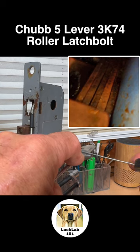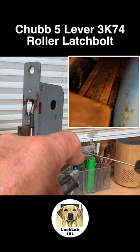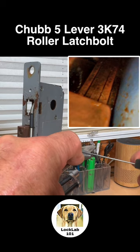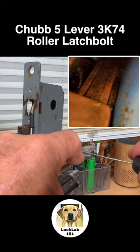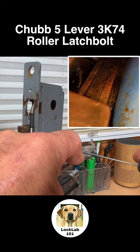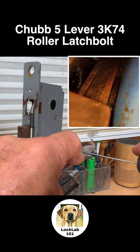Let's try three. Three is bound. I've just lifted three up and the lock has gone into anti-pick. One's tapping, two's tapping, three's tapping, four is tapping, and five as well. One of these is in anti-pick — I'm not sure which one it is. Let's see if we can see. I think it's lever two actually. Lever two is in anti-pick.